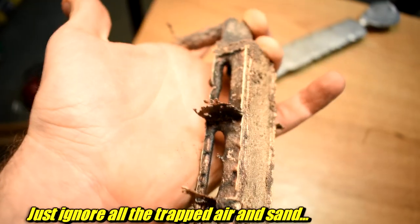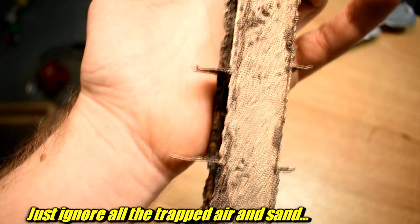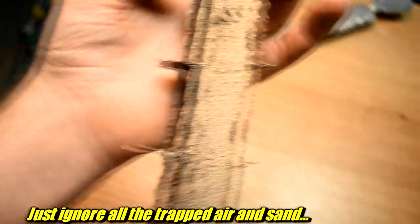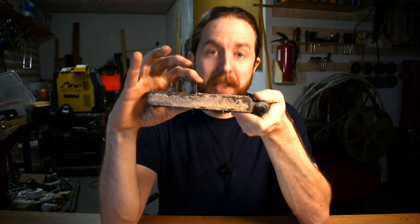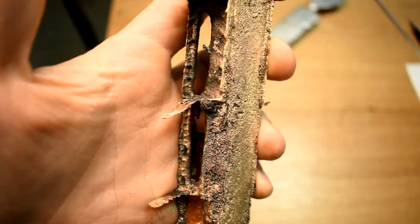And then it leaked in between where the wood and the wood was. Now they were tight, pretty tight, close up together. And it still formed these little flanges poking out, which are paper thin, which means the aluminum couldn't make a 90 degree corner, but this could make paper. I could almost make like 24 gauge sheet just by casting this stuff. You know, there's a good reason why they've been using that alloy for thousands of years.